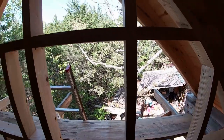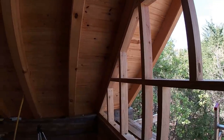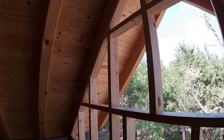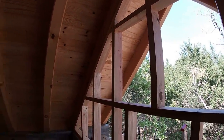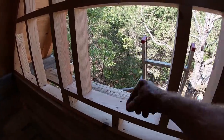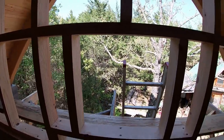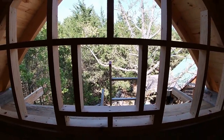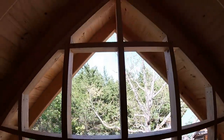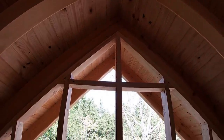On the inside I went ahead and drilled for the electrical. It's not likely I'll have any electrical in this gable wall — it would be a sconce light, but it'd be difficult to get up there to change bulbs. We have three sconce lights on the gable in the living room of our house and it's hard to get to them. This area right here is framed out for where the stove pipe will go through. I opted for triple wall pipe rather than a masonry chimney, as it would be a really tall chimney from the ground all the way through the peak.